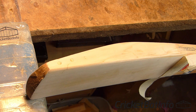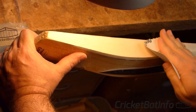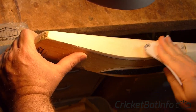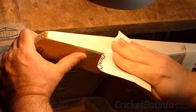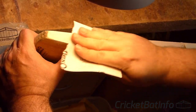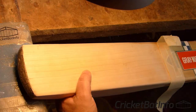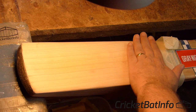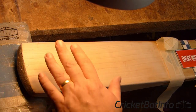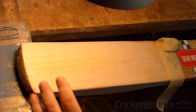What I need to do now is just do a little bit of hand sanding. The whole point with that sanding at the end is more of a polishing technique, is to try and vary the directions. If the sanding marks are all going in one direction, any sort of real deep scratches will stand out. They're going different ways and in circular patterns, and then finishing along the grain travel is more likely to get rid of some.